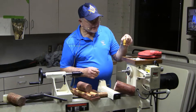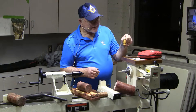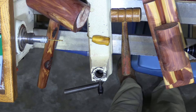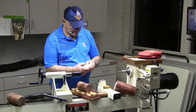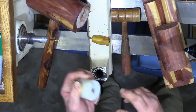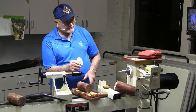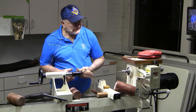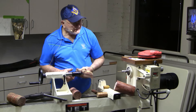I made a lot of bottle stoppers and I was using Harley-Davidson golf balls — I wanted the insignia to be dead on top. You'd line it up where it's dead on top, then when you put this in your lathe and chuck it up, you drill right straight through it and your hole will be so that the insignia is straight on top. You can make one of these to fit any kind of ball you want. It's a simple little tool to make and it will always put your hole where you want it.